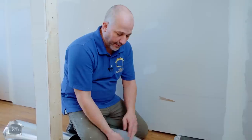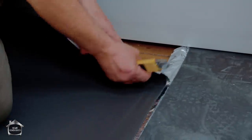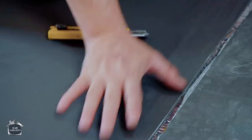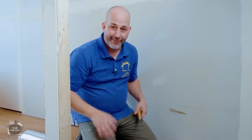Most underlayments come with a two-sided tape so you can peel it back, lay it down, and create a nice vapor barrier. This is a great technique — you can actually install this flooring on a concrete floor in your basement and put hardwood right on top. Use a subfloor system, put in the underpad, and you can have hardwood in the basement. Because it's a floating floor with no fasteners, you don't have to worry about affecting your vapor barrier.